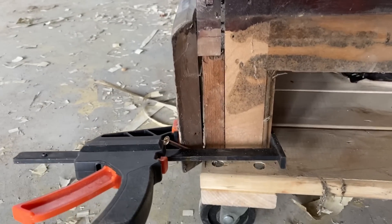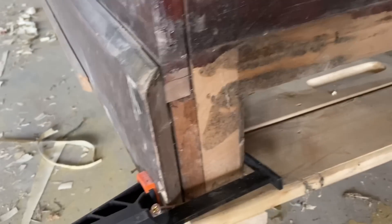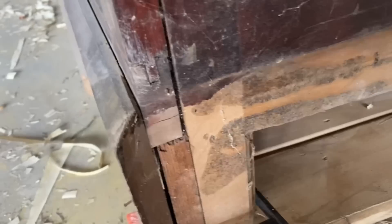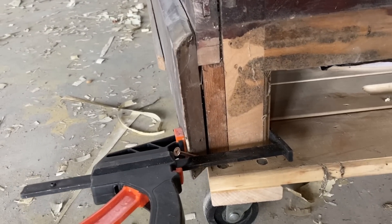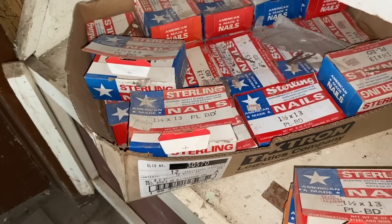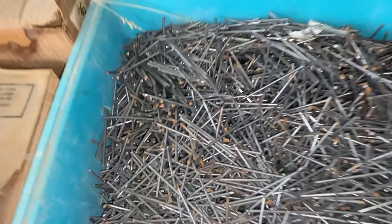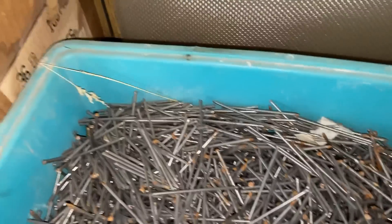As much as I would love to put a screw into that, I can't have any modern screw heads showing up on here. Theoretically I could put one in from the other side, but I think the thing I need to do is get some long finish nails and do it like it would have been done. I was just looking through all these different boxes trying to find the exact right finish nails, and then I thought — I have the perfect thing. It's right here: a gigantic bucket of really long finish nails. I'll just take a handful of these guys and we'll be good to go.